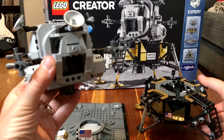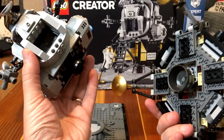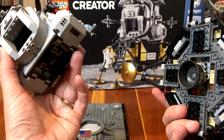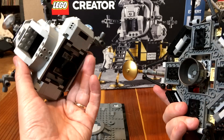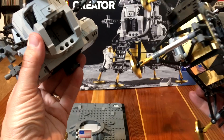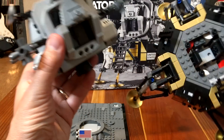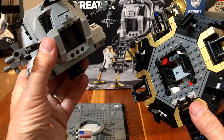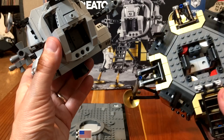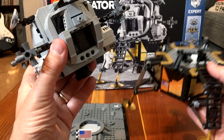So you have the ascent module and the descent module — they come apart. You have the rocket engines in there. That's the descent engine, highly throttlable — a very important engine in rocket engine history. One of the first engines to use a pintle injector, so it could get deep throttling capability. Inside you can also see the fuel tanks and the oxidizer tanks, but they're not quite in the right place, though I'm glad you can see them in there.